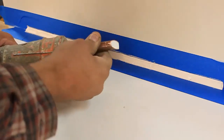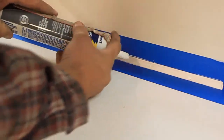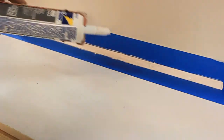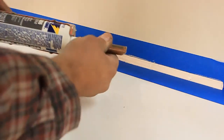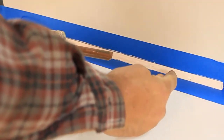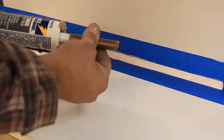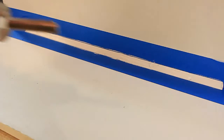You can always take it off, clean it out, or use it for your next project. As you can see, if you had to try and use that without the extension, it would be kind of hard to get in there. The caulk runs a little bit in your way and you don't get that wide of a caulk joint. Mostly you're going to use this for the outside, on your siding, your brick. You can also make this longer if you have something to caulk that you can't reach or it's hard to get the tube in between somewhere. Use a piece of copper, extend it out a little bit longer — that'll help you get in to reach what you have to caulk.